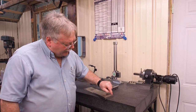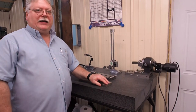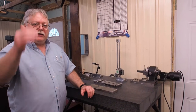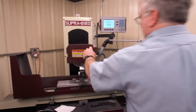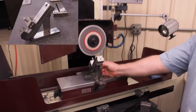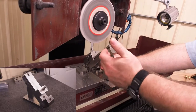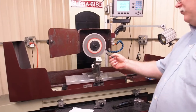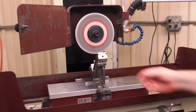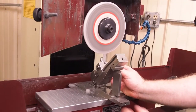We're going to grind and refresh this surface and try to get it so it lines up good and true. In order to do that, I'll have to dress the grinding wheel at 45 degrees and set this up. We'll show you how we're doing the angle on the surface grinder right now. This is another tool that I made years ago — it'll be another project I'll have to refresh. I have the gauge block stack set up so it's at a 45 degree. I've already dressed this wheel out — I roughed it out with the boron stick and then trued it up.